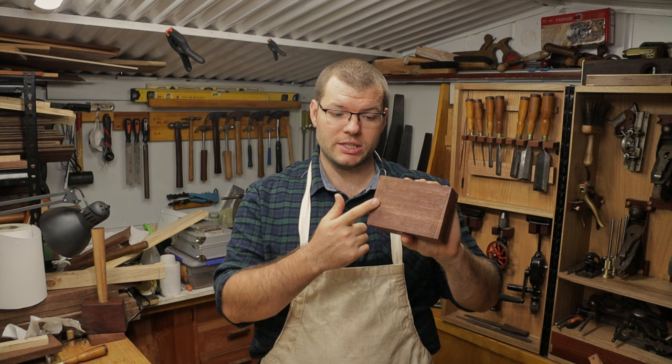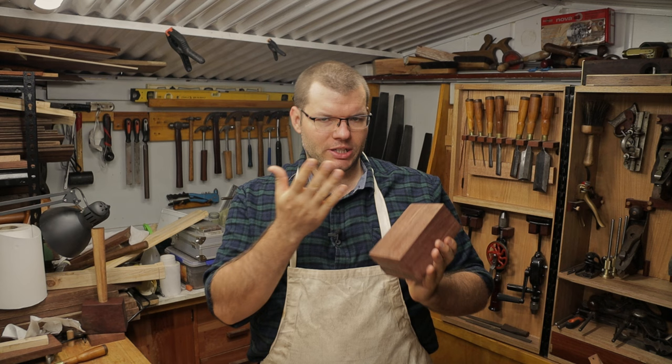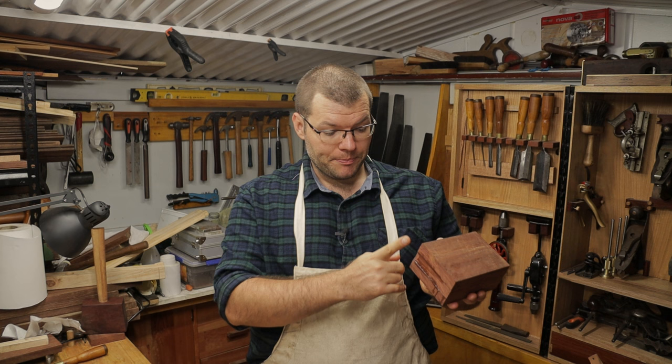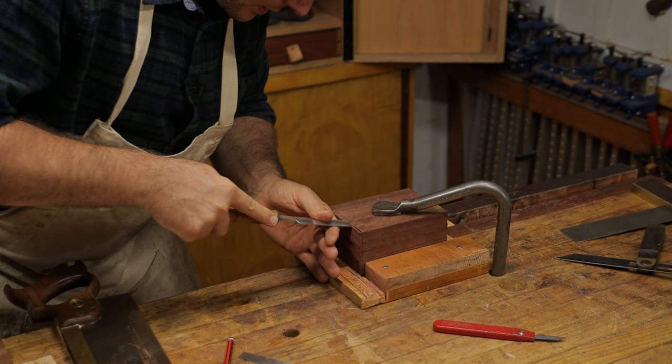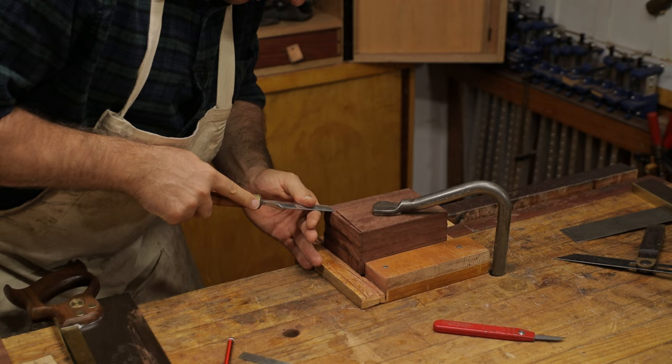So when it comes to sawing an angle like this, I know we haven't really covered any sawing of angles here, but essentially it is still a straight line that's on an angle, so just treat it like a straight line and just saw straight, but you're just going to have to be much more careful and just really follow those knife lines. And in this case, you can use the chisel, make our little knife wall as it's so called.